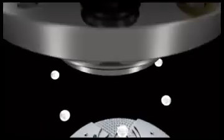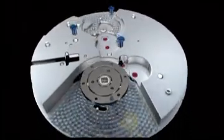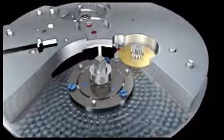The barrel drum of the Eterna Calibre 3800 is mounted unsupported on ball bearings on a collar screwed onto the bottom plate. Its tilt and end shake are minimal. The engagement in the adjacent watch train is almost perfect.